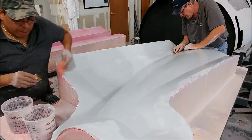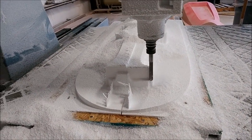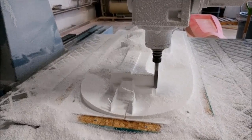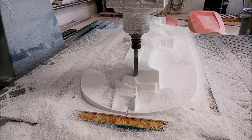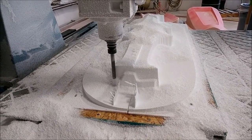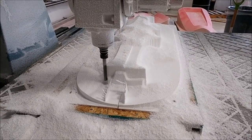The mill is a little further along on these rear seat mounts. You can see a switch to the ball mill here — the flat mill was running all the flanges and getting those done, and now the ball mill is going to step down and trace out the whole pattern. It's much easier because there are all kinds of little transitions and curves — it's just impossible to run that with a flat mill.